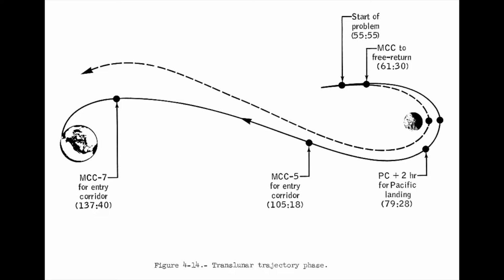Now, they are still not out of the woods in terms of power. They need to recharge their re-entry battery A that had saved them earlier. They will do it thanks to a cable meant to recharge the LEM batteries from the CM and a hacked procedure to use it in reverse, involving hundreds of circuit breakers.